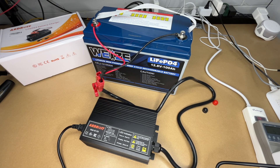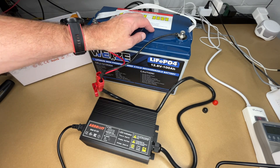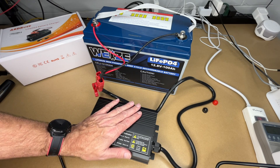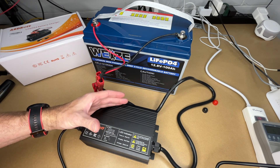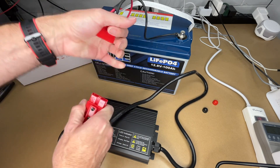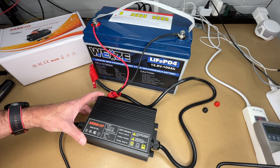This battery is eventually going to make it into my camper. I haven't upgraded the power center in my camper so it's not technically compatible with lithium — it could charge it but not all the way. I'll have solar that can charge it fully, but the sun may not always be out, so it's nice having this charger to top it off before camping. In the winter I may take the battery out and store it in my basement, charge it with this charger, and hook an inverter up to it for emergency power if I need to run a fridge during a power outage. I like that this is a 30 amp charger — there are faster chargers, but 30 amp is a good balance where you get a decent charge rate without putting too much stress on the battery. I really like this connector too; when I'm done I can just disconnect, leave the connector on the battery, and plug right back in when I want to charge. If you're looking for a charger for your lithium iron phosphate battery, I think this is a great option.